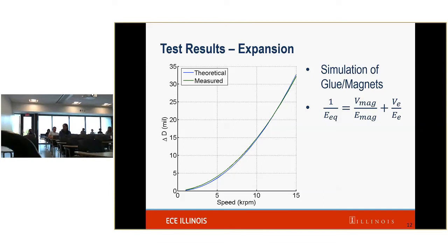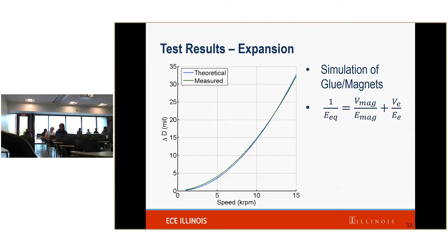So I should be having lesser torque from the motor. For this kind of application, if I understand correctly, it's like a quadratic load torque speed characteristic. So this is for propulsion, like a fan speed. There's two things going on, right? Especially our test did not have, was in a vacuum. So do we need to overdesign for that condition to make sure that even under expansion condition I have enough torque generated? Yes.